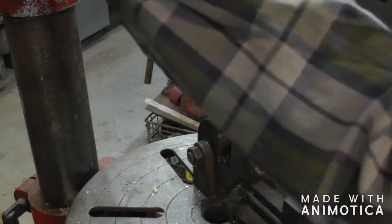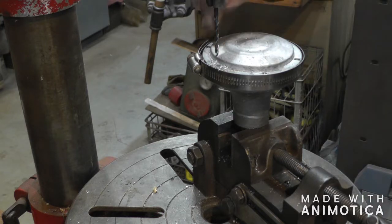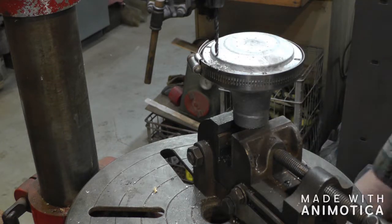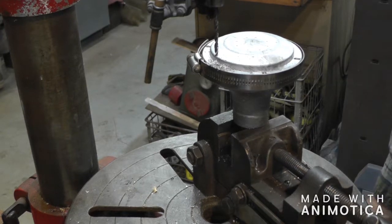The clamp seems to be holding it. Good shape. Probably what I might do is I'll just find another 29 drill and stick it down in that hole just to make sure nothing shifts while I do the other 5 holes. So I'll get back to you when I get those done.